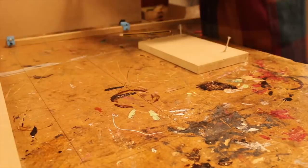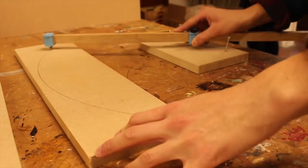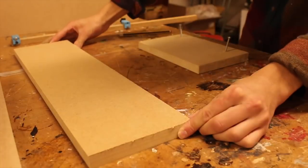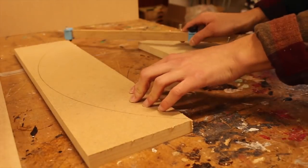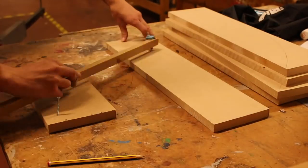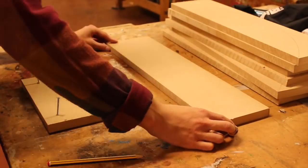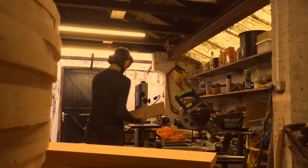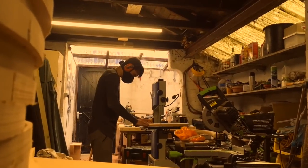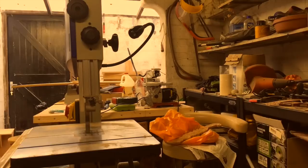I made a very simple jig here — I just marked out a rectangle on the workbench and used a large compass to mark out the radius I want on each piece of MDF. Now I'm rough cutting it so it's easier and I don't have too much material to remove with the flush cut bit later.